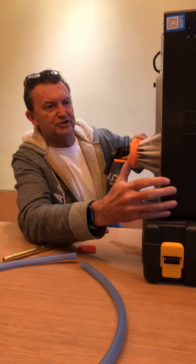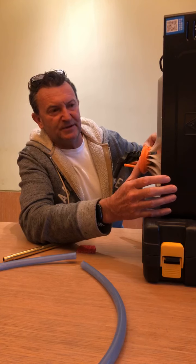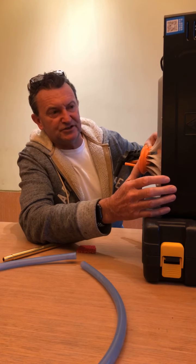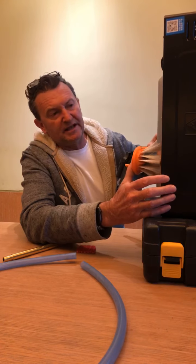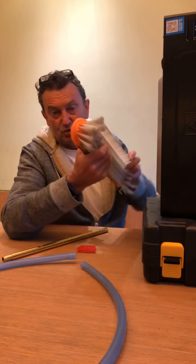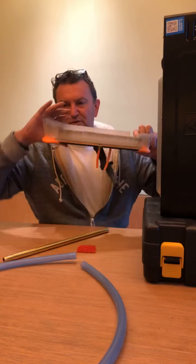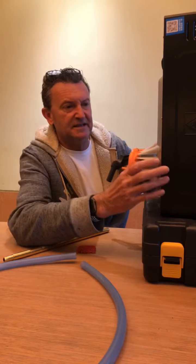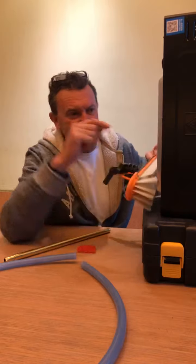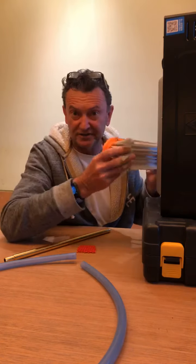So we want that brush to splay, like that. That spreads the bristles at the right angle and activates the internal bristles, which gives us more agitation per stroke. That's why we change the angle of these, so they take less force to splay. We need force in this direction or this direction in order to get the bristles to splay.